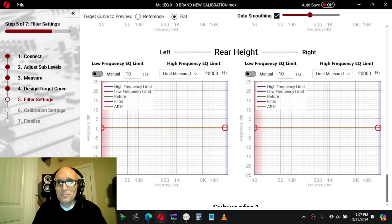So yeah, let's just go up to 77 and then maybe just really quick check a few more above and see how we're doing, generally speaking. Now, yes, we're bringing the levels down, but the levels I put back in on the subs, that volume loss, so we're having a volume loss of 10 dB on the receiver, and MiniDSP is putting in a lot of negative EQ here as well. So you are so far away from clipping. You are really far away.